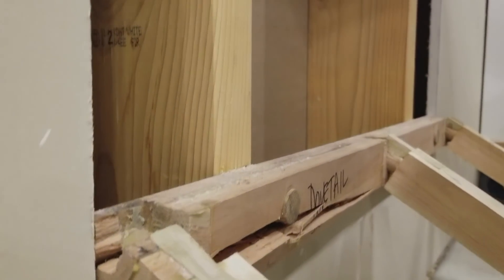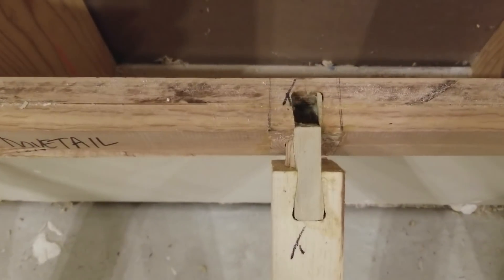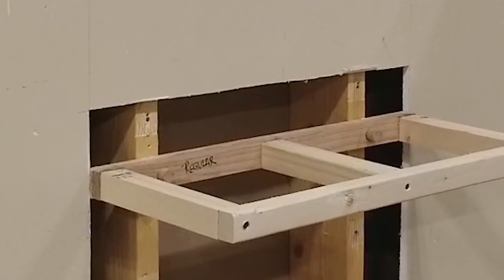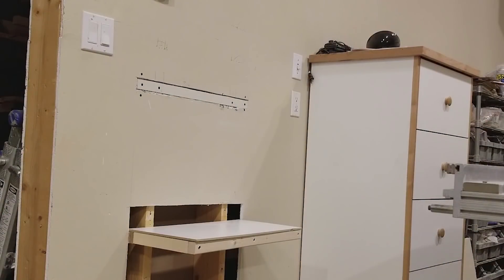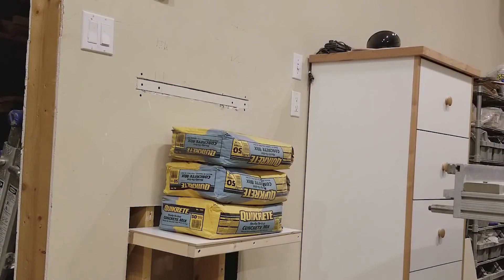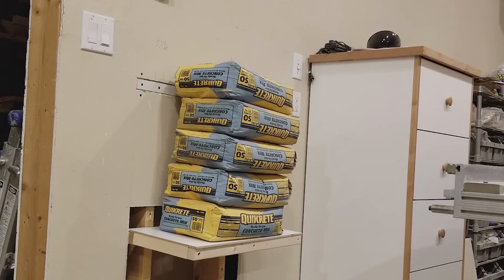Here's an interesting comparison between the shelf I broke by leaning on it with my body weight in the previous video and the break in the dovetail construction. Looks like the pine and oak are reacting similarly to stress, but the oak handles more weight even with the additional three inches of shelf width, which is not surprising. The middle dovetail literally sheared off and remained in the joint — which shows that the glue is stronger than the wood grain. I decided to mount my go-to regular shelf with oak dowels at 12 inches wide for one last hurrah, but I think I've learned all I need to know about floating shelf strength. These tests have been pretty extreme, but they give me confidence that any of these three shelf designs probably gives two, three, maybe four times greater capacity than you and I are ever going to need for our floating shelves. Thanks for watching.